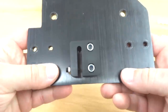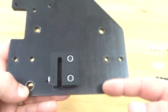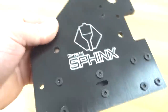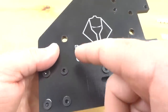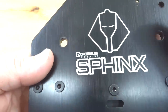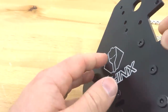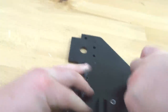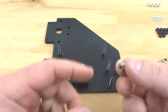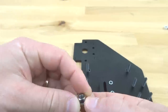The top portion is going to be simply a fixed wheel, so that'll be our aluminum spacer. Rotate the plate around — same concept on the back side: the larger spacing at the bottom is for our eccentrics. Feed the screws through, and also put two more here on the top for our large extreme wheels — those are also eccentrics, as the holes are slightly larger than our fixed wheel holes. Put two more 27 millimeter screws in place and rotate the plate around. Now that we have all our screws in place, we're going to start our stacking configuration, starting with the bottom for our eccentrics. Grab one of your eccentric spacers — the marked side is going to be facing away from the fixed wheels, towards you.